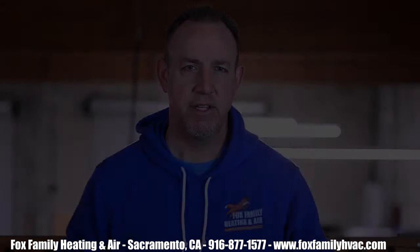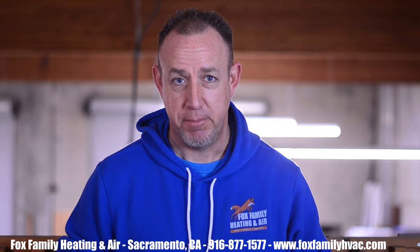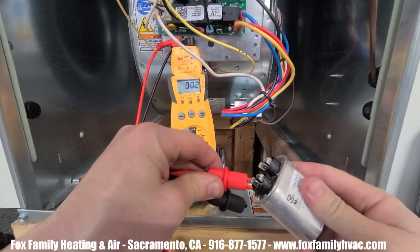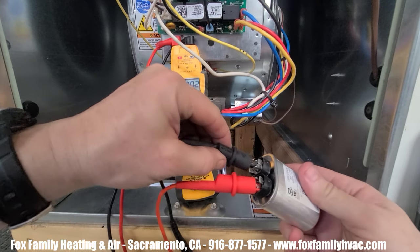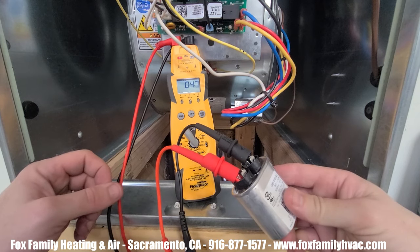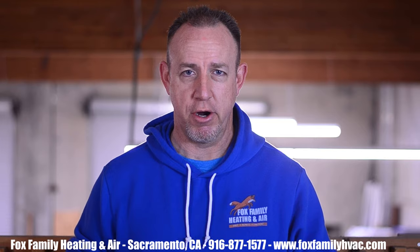This video is all about the commonly used PSC motor. PSC stands for permanent split capacitor. The capacitor is a storage bucket of electrons that helps regulate the voltage going to the motor as it starts up and continues running through the cycle. Today's capacitors typically last 5 to 10 years, but as always can run much longer.